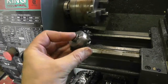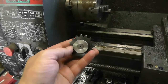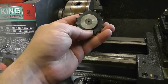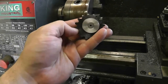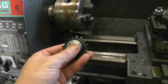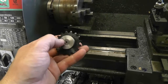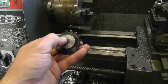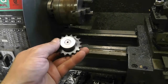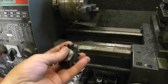Okay, there you go, that's one done. I'm going to run just two small beads around the edge of this. I'll sandblast this face off but I'll just do that much, because seeing as how I got that roll pin there, the weakest spot is not going to be any weld — it's going to be that roll pin. I'll run a little light weld around here. I'll probably just use a fusion welder; I probably won't use any filler. We'll see how it works.